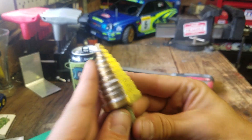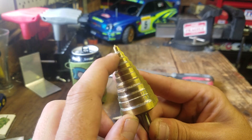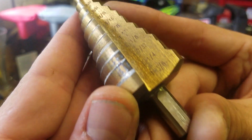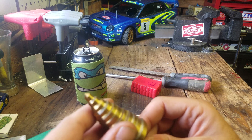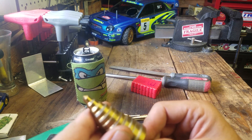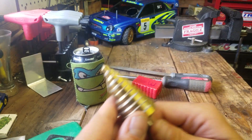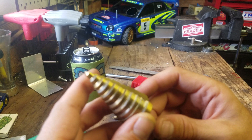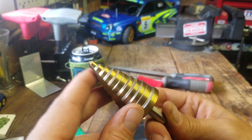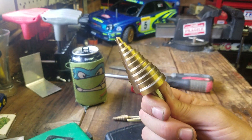On top of that, this comes in a two-pack set. This one goes up to trade size 1 inch, which actual size is 1 and 3/8 inches, so that'll put a 1 inch knockout in something. Say you knocked out something to a half inch and it doesn't include a 1 inch knockout — now you need to make it bigger. Your only option is this, because you can't use a hole saw on it, or a knockout set which is heavy and a pain in the ass. When you just run this into a 3/4 inch hole and make it bigger, it has many uses. If this is all you got, you can make a half, 3/4, or 1 inch hole with just this one piece.